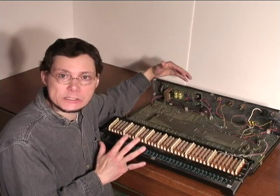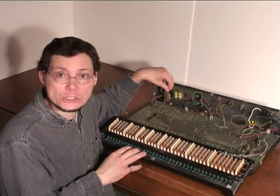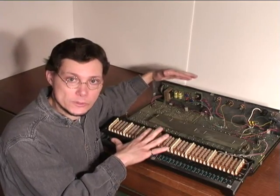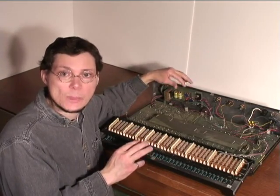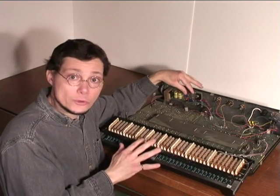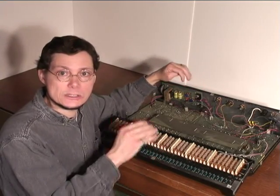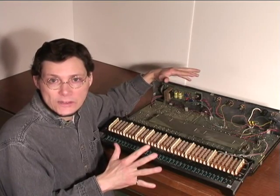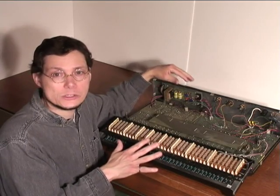The next thing to look at is the power supply, located at the back where the line cord comes in. It's comprised of three main sections. The first is the transformer, which takes the relatively high voltage at the wall socket and lowers it to a value useful for the synthesizer circuits. The second section is comprised of four rectifier diodes and a pair of filter capacitors, which convert AC voltage to DC and filter out any ripple. The third section is a voltage regulator that supplies a constant DC voltage — for this synthesizer, that's plus and minus 15 volts. The filter capacitors only have a useful lifespan of about 20 to 25 years, and even ARP Odysseys made in the early 1980s are that old, so you want to replace them.